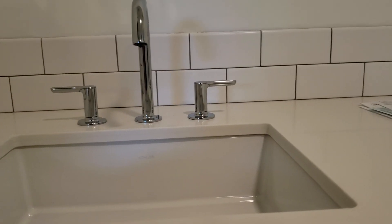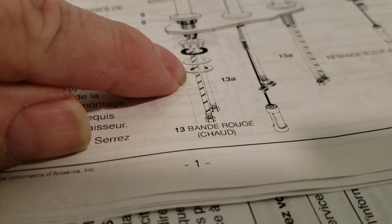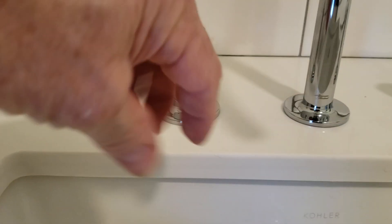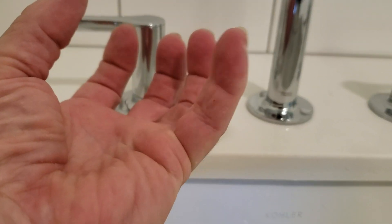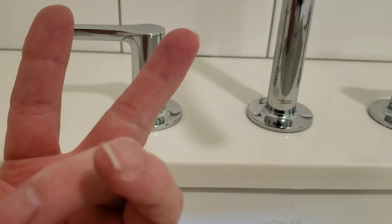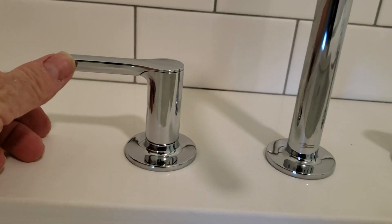The faucets are widespread — not a bad mounting system. The cut sheet showed a nut with two stainless steel set screws instead of just one nut that turns and tightens. The thing I don't like is that as you tighten it, it spins the whole assembly. A lot of manufacturers now use one large brass nut that screws up to a point, then two to three stainless steel screws tighten it straight down and pull the faucet into place.